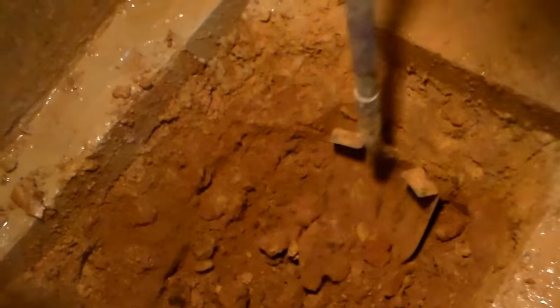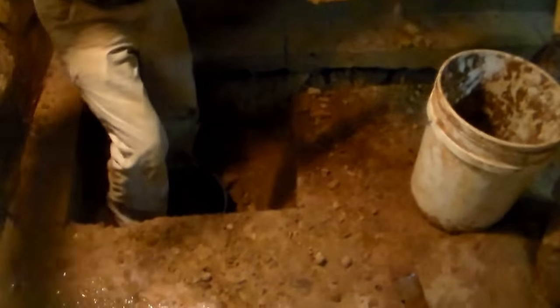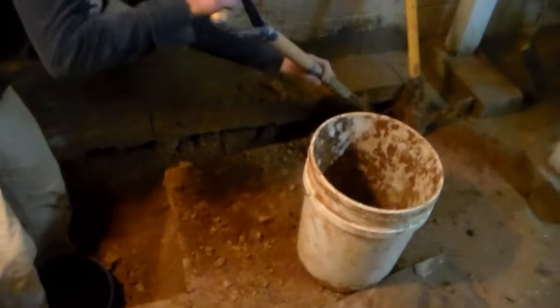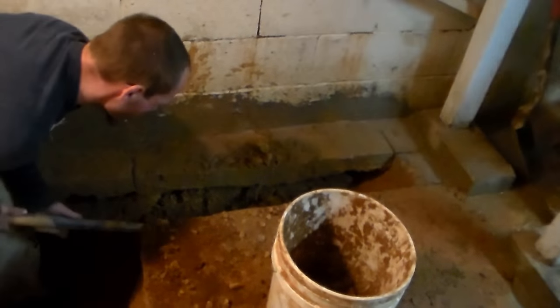You're about three quarters of the way once you clean that out — pretty close. We have our site dug out here for the pit. Now we're excavating a little bit more to get over to the block wall so that water can enter our trench. Then we'll plumb it up. I've already started the plumbing here. We'll bring it up through this wall. We've already cored the outside where it goes out through the foundation wall and we'll plumb it outside.